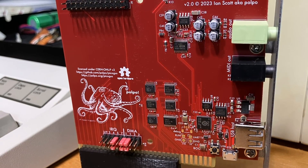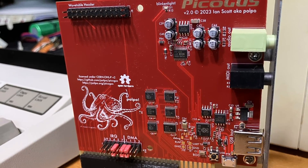The PicoGus is an ISA sound card replacement. I did another video showcasing some of the initial functionality. Since then, there's been a number of updates adding SoundBlaster support, and now it supports a number of different cards. Initially it was created as a Gravis UltraSound emulator card and uses the Raspberry Pi. The latest functionality I'm excited to test out is a CD-ROM emulation update in the firmware. You can use it either in the USB mode or in the SoundBlaster mode, so you can have the card set up as a SoundBlaster and it will also support that CD-ROM emulation.